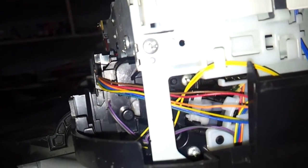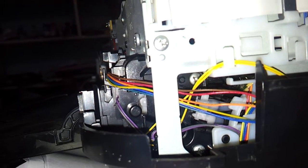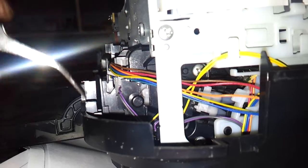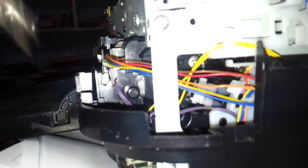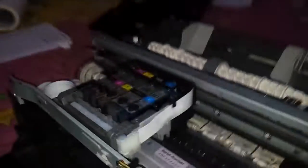That's the cam wire sensor. If you're having an oxidation issue, that switch is not working correctly. You can use contact spray or contact cleaner to clean it — blow into that switch so that it cleans the insides, and press it manually so the liquid goes in and cleans out the oxidation issue.